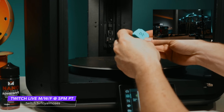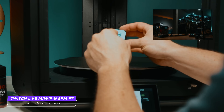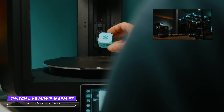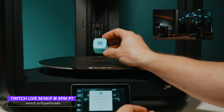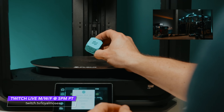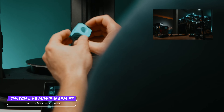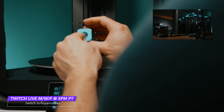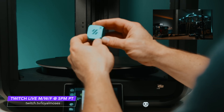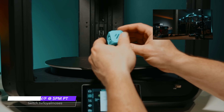I see some evidence of vibration — a lot of vibration. You can see that it's not tuned for this filament, and there are under-extrusion issues. I can see a lot of vibration artifacts, a lot of ringing.